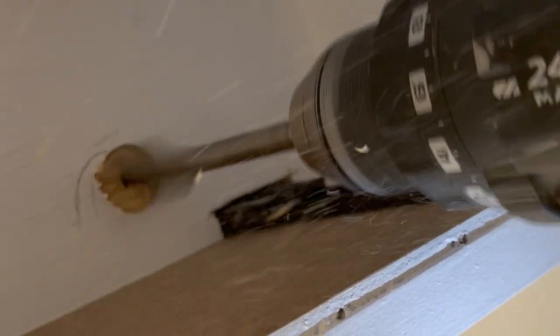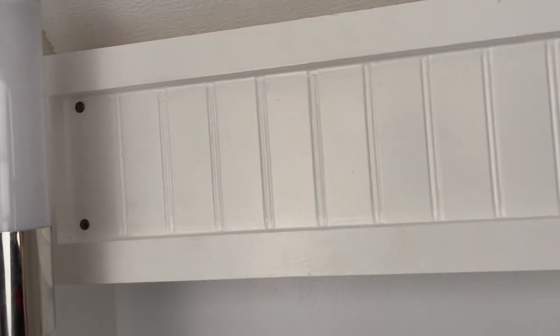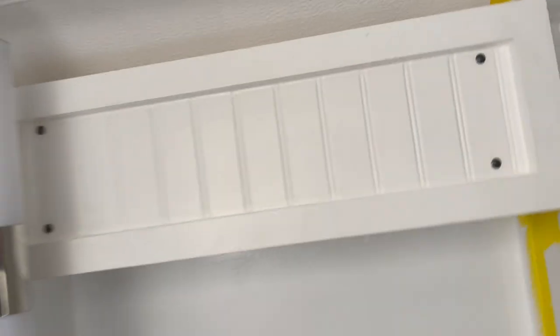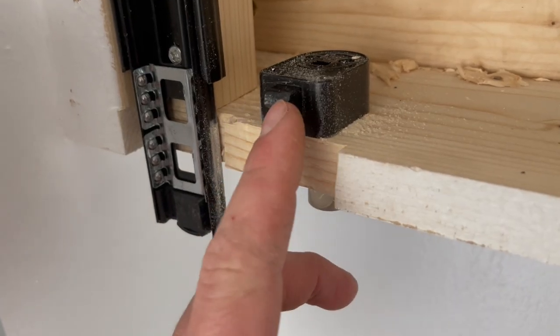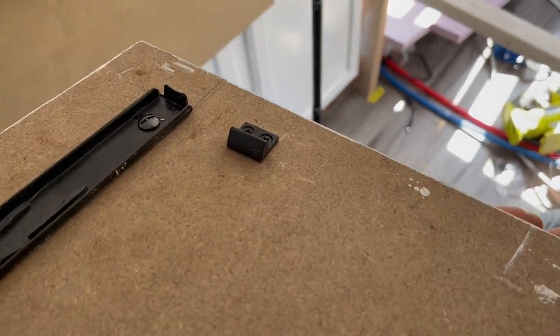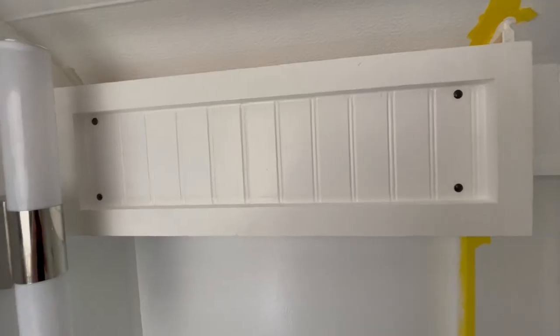Next was just drilling a hole for the latch. I didn't really have a template so I had to figure it out on my own, but I did make it work. I spent a lot of time fiddling with this thing. I ended up having to trim a little bit off the latch and take out some more wood to fit the locking mechanism on the other side. It looks a little rough but once it's closed I really like it, and even if it does look a little rough it doesn't open enough for you to really see that part.